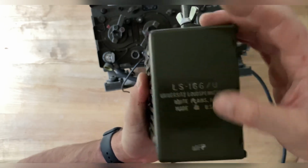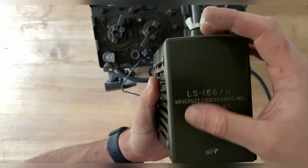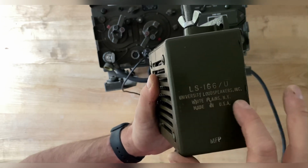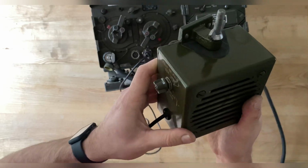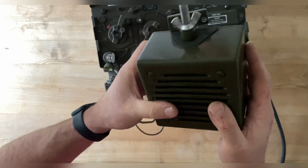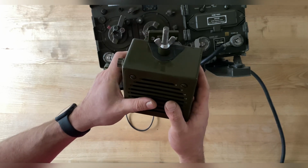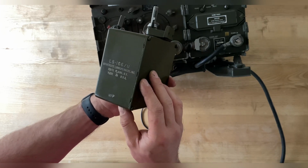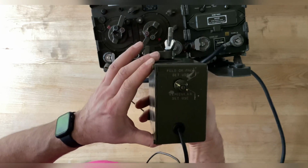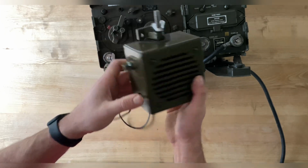And then I went over with probably 1300 or 1400 grit sandpaper, smoothed off the masking lines, and then gave it a coat of satin finish lacquer. Unfortunately, the lacquer that I had has caused this to be a little shinier than my preferred lacquer. So I'm just waiting for my preferred lacquer to arrive, and then I shall put it on here and finish this unit off.